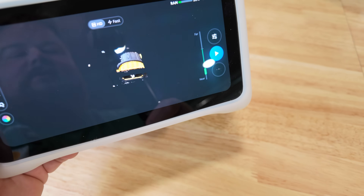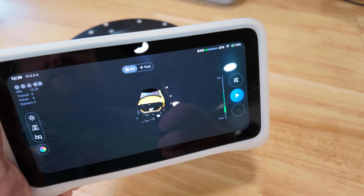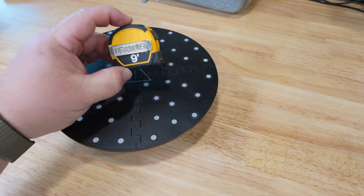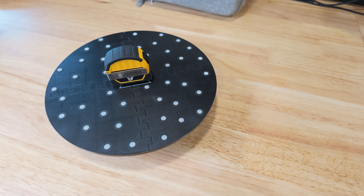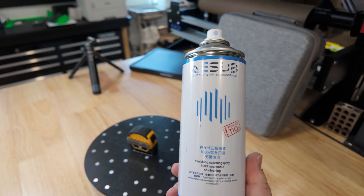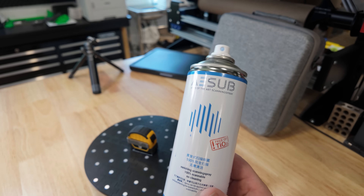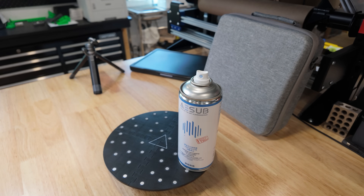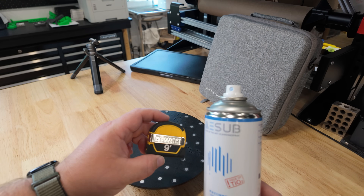One thing to note: if you look at that graphic, do you see how the silver belt clip is totally missing? That's because it's reflecting and not being absorbed by the scanner — it doesn't see it. So in this instance, I need to hit this with some scanning spray first to make sure this detail scans and I don't have voids. This scanning spray is from Amazon — it's made for 3D scanners and was highly rated. I'll put a link in the description, along with the turntable, since both items are not included but you're absolutely going to need them in my experience.